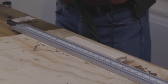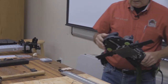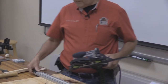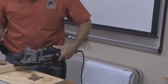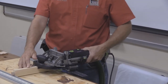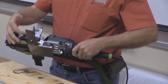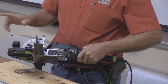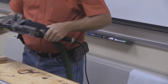The other attachment is this one, and I can actually use this one while those are still on, but not the other way around. This is the one that I use to cut the ends. I can set it for the one inch — it fits right over the end, and then it'll cut right in the center. I've got settings for the depth — how far I've cut from the top of the work surface, and also how deep I'm going into the piece of wood.